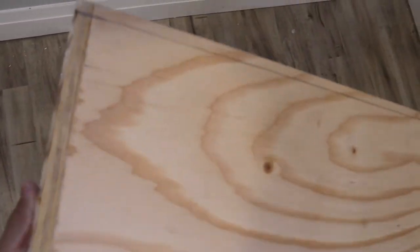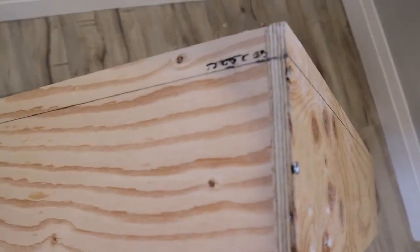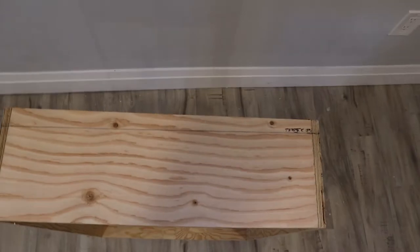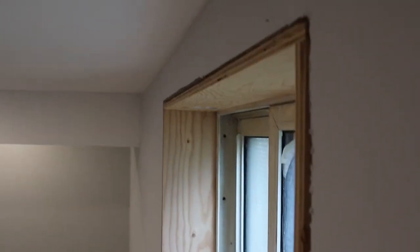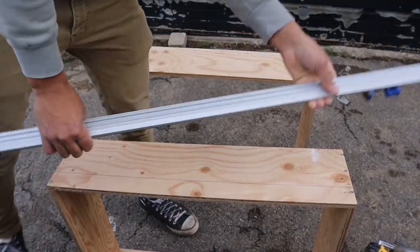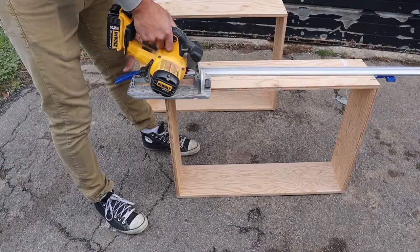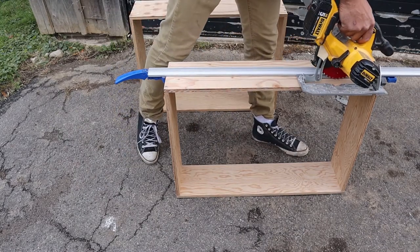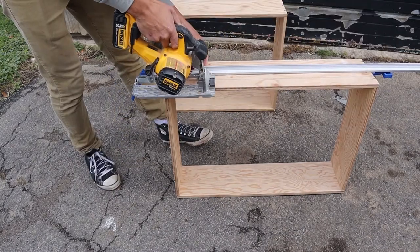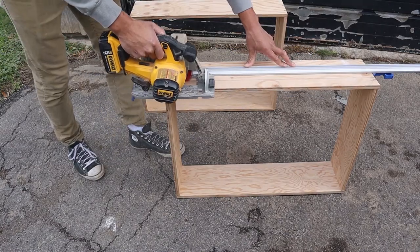I'm going to put a cutting guide on this and just use a handheld circular saw. I'm going to be cutting all around on all four sides. And then once we're done with that, we're going to end up with a window box that's going to be exactly like this one here — nice and flush to the wall and ready for trim. This is just a cheap cutting guide you can pick up on Amazon; I'll leave a link in the description below. I'm just rolling the blade along that line to make sure we're accurate. And this is the final cut here.